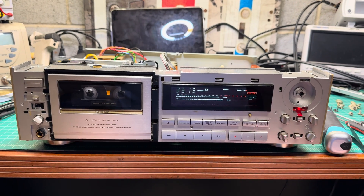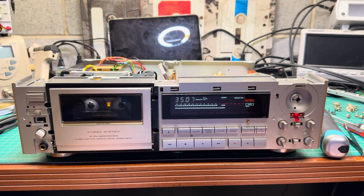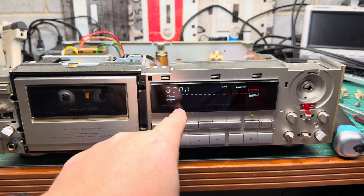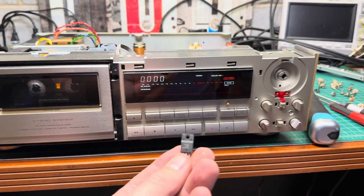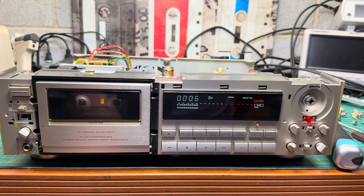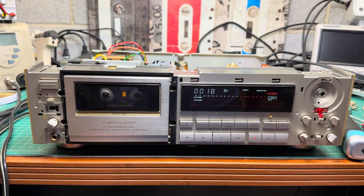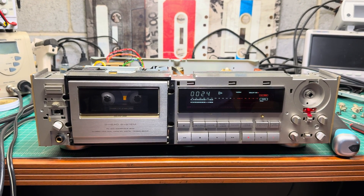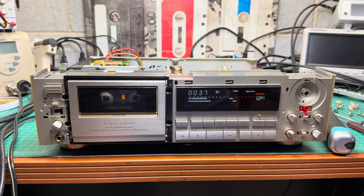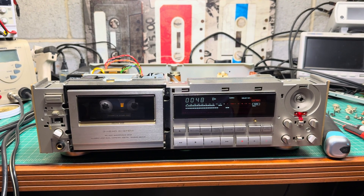These two and these two transistors power the audio part, and the rest here powers the rest of the board - electronics, motors, and so on. I'll continue my research; it's time-consuming as you may see. I will probably start measuring temperatures to see what part is heating up and triggering it. I replaced the five-volt supply chip and thought it would start working, but it still flickers. Nothing helps. I'm not sure what else I can do.